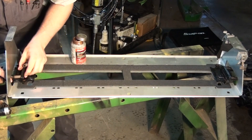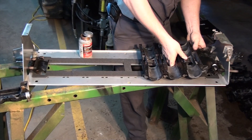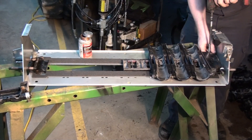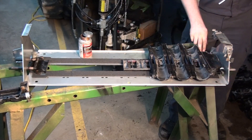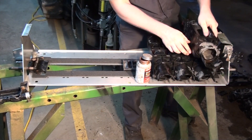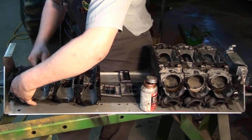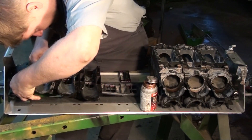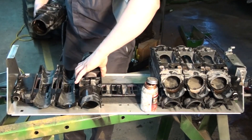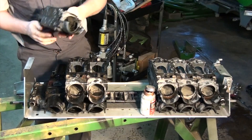Next we will take the plastic manifold components that we have washed and will be reusing with this installation. Line them up with the bracket mounting holes in the same orientation as they were removed from the original manifold bracket. Most of these parts will clip together. When installing the components for the selector slide, it is important to ensure their position in either position does not block any runs, but permits seed and fertilizer to flow to the upper or lower seed tubes as selected. This is outlined in more detail in the John Deere 1910 technical manual.